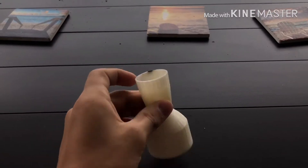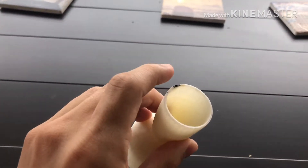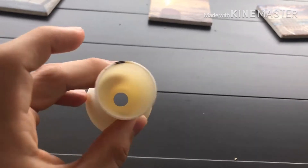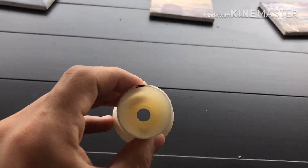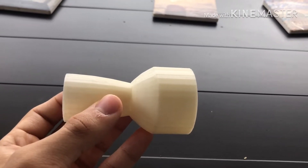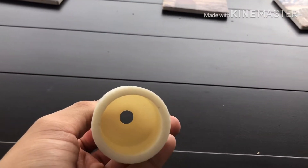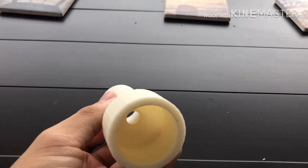One thing you can notice in the video is that the flames don't really stick to the outside of the nozzle — ignore this burn mark — meaning the pressure inside is not high enough for it to start expanding out through the throat. This is a convergent-divergent nozzle, and it only really works when you have supersonic flow, which this throat hole is not small enough to create.